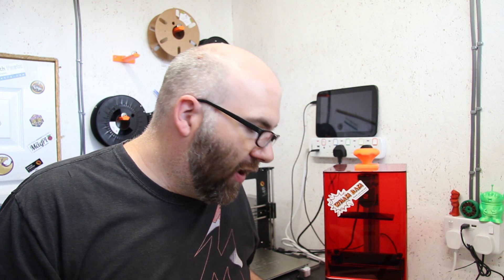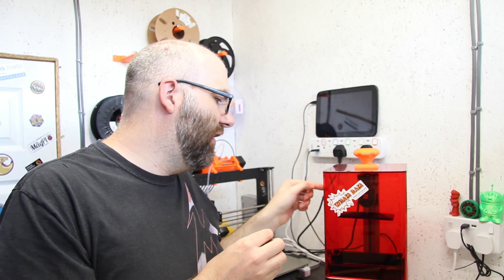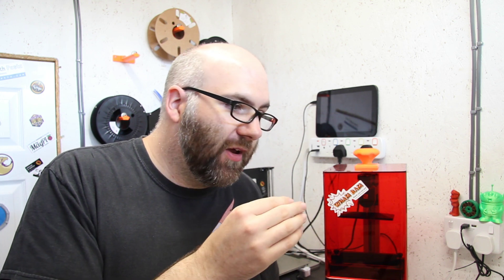With the Elegoo Mars there is only one very slight modification you need to make to the machine — and I wouldn't even really call it a modification. It's basically adding this tiny little spacer, which lowers the arm that triggers the Z sensor. The reason for this is that the magnet being put on the bottom of the build plate is quite thick, so you're bringing the whole surface down. This spacer resets the trigger point to take that magnet thickness into account. There'll be a link in the description to the Thingiverse page for this spacer — it takes seconds to print on an FDM, or you can print it on a resin printer too.